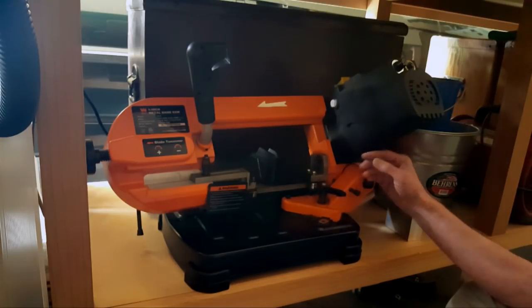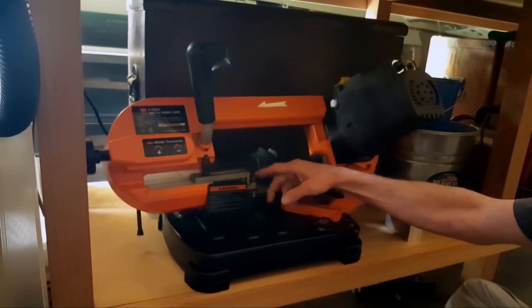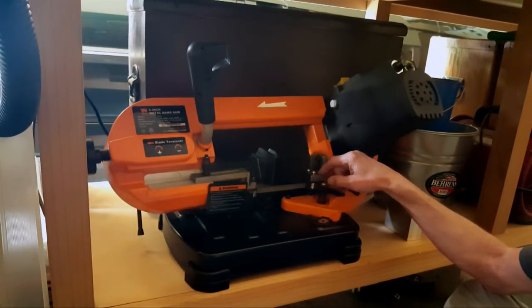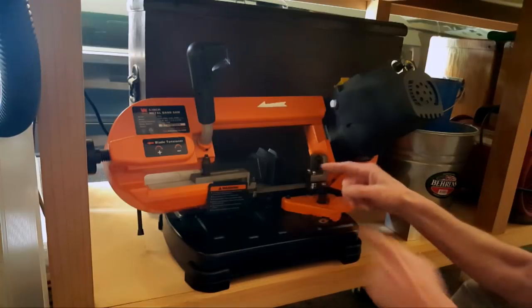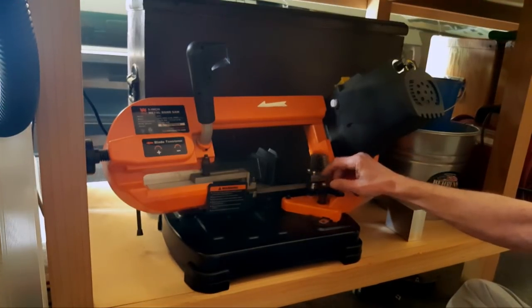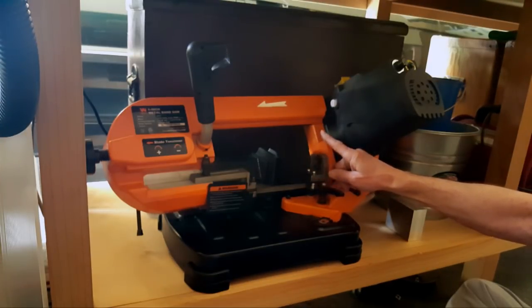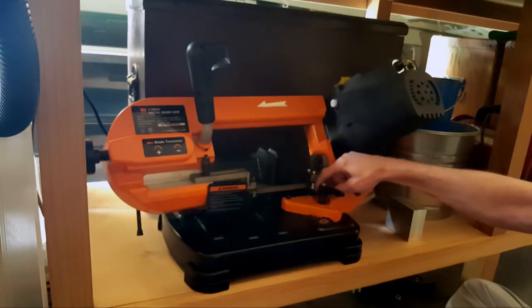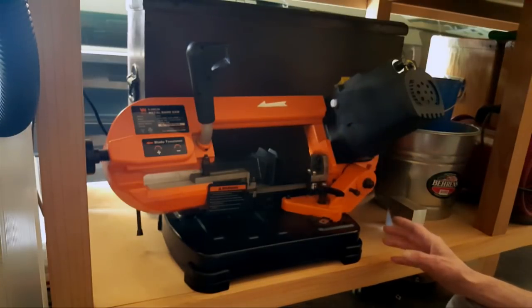Now the rollers are off the teeth. Oh, it just went on and on. What I finally wound up doing is I left this side alone because it's always seemed to be fine. This side, get rid of the lock washer because the lock washer was digging into the metal, making it not a flat surface anymore, which caused the bearings to do this number again. So I had to file the surface down to get it flat, put regular washers under here, replace the acorn nuts with nylon lock nuts. And now when I spin the bottom piece, this stays put. It'll just move with it on top of the washer.